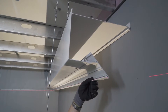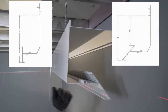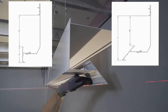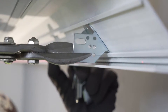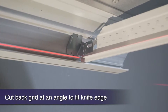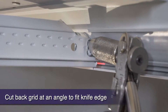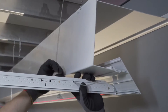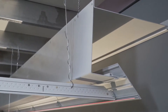The bottom extruded profile comes in a classic or knife-edge design, which needs to be leveled by tying in the lower Armstrong grid system. We will be installing interlude dimensional grid, which requires snipping off the lower portion of the Axiom CCLT45 clip so the grid's teardrop can rest on the cove's flange. Two pop rivets or screws will secure your grid to the cove. Watch the lower cove extrusion level out as the grid's hanger wire is secured.